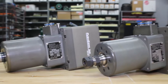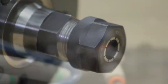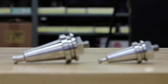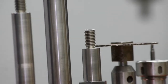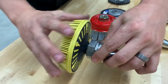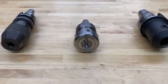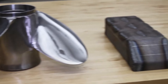PushCorp spindles come in two tool holding configurations: BT style tool changing and ER manual collets. Air pressure actuated, industry standard BT style tool holders are our most popular tool changing option. Our spindles accept either the BT-30 or the larger BT-40 tool holder, depending on the motor size. PushCorp has a series of custom BT style tool holders with a 5/8-11 thread, which is common for hand tools and can be used to mount a wide range of abrasives. Many off-the-shelf BT-30 and BT-40 options are also readily available from various tool suppliers, and their performance and flexibility make them the go-to choice for most any application.